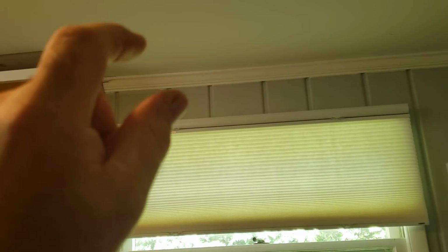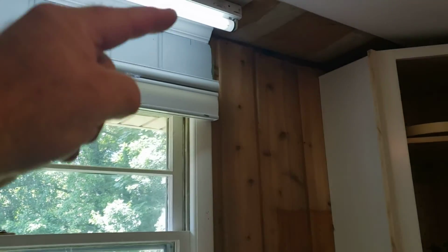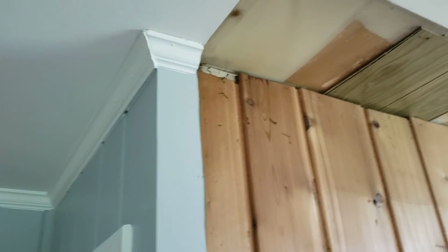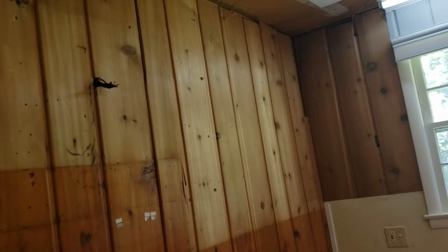Now if you look, that means we're going to take this piece of molding down overhead. We're going to put regular molding there, the store stock MDF molding. Then we're going to come out with it, go down across, down the side of that 21-inch cabinet there, cross behind the light, up the 9-inch cabinet, across, and then back down to the end of the run where the stove is. And it will tie in right here at the end of the run like the old cabinet moldings. Looks great. It's exactly what we need to do to be able to fix this issue with the molding styles.